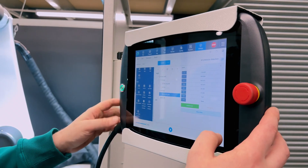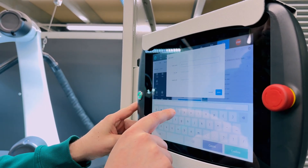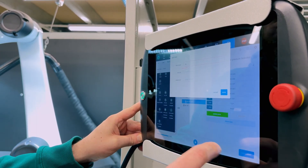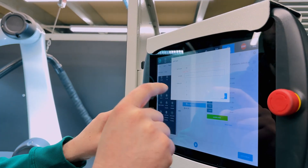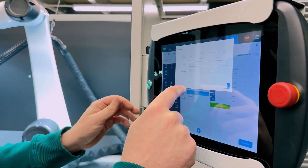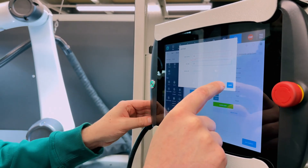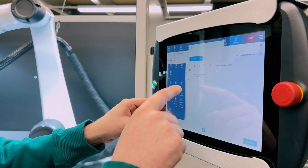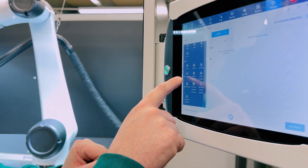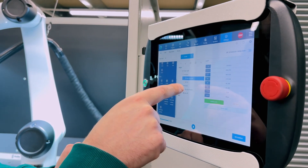We've come over to the teach pendant and the touchscreen controller. We press 'create a new job', call it TIO, and press enter. Arc job — this relates to the weld parameters, like a craft table that are preset. It comes with some basic parameters. '20' is a weld down and that's exactly what we're going to do. We press save — as simple as that. Then we have options for which weld type: we want a linear template. We push that and it populates all the weld spec and information.